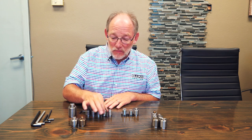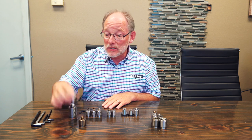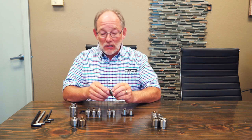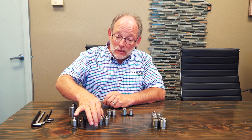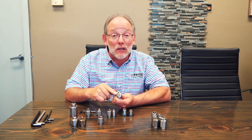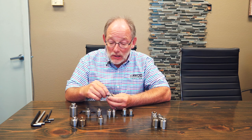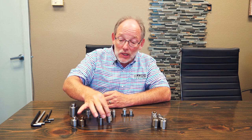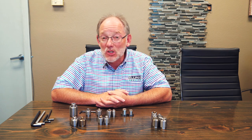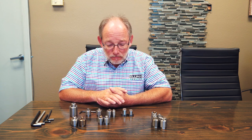As a general rule: 3/8 is always going to be light-to-medium duty, half inch is heavier duty, and then 5/8 and of course 7/8 is really heavy duty holding power. Now I have another fastener here that looks a lot like the classic — you may not be able to tell the difference — but this is an all metric fastener. It has a metric thread on the outside, a metric thread on the stud, and an M6 hex wrench driving it. If you need a metric solution, this is your fastener. It's called an IVB, and it's M12 by 1.75 — that's the pitch on the threads.